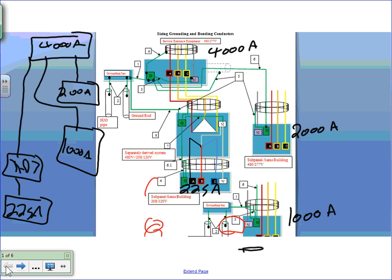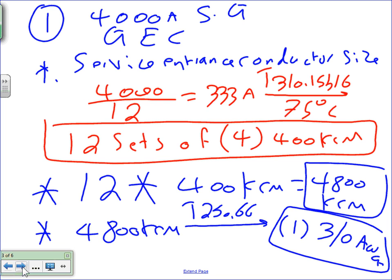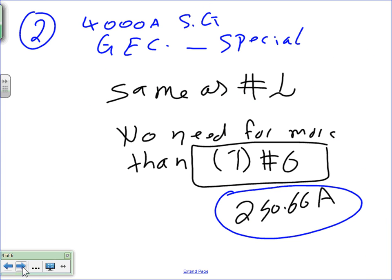The service conduits, if they are metallic. If they're non-metallic, do I need to bond PVC? Well, do we bond wood? I used to think it's no, until you read something about high voltage. Yes, it's a whole different arena. You start bonding because of step voltage and mesh voltage. As of now, the answer is no. We don't bond non-metallic. PVC, yep.